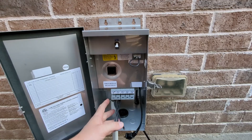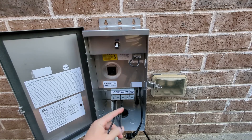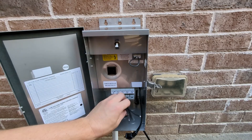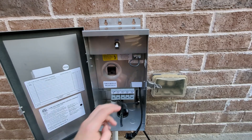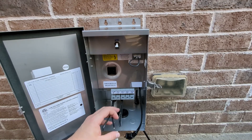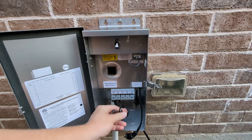So we've got two wires here. That's pretty common for an installation. Two wires can handle quite a few lights, especially because everything's LED now. So let's say one wire is a main wire for the left side of the front of the house and the other one is for the right side. Make sure that you do it correctly because if you don't, you can cause your landscape lighting to be dim, flicker, not turn on, or keep shutting off the transformer.